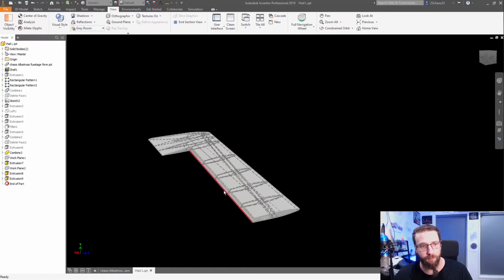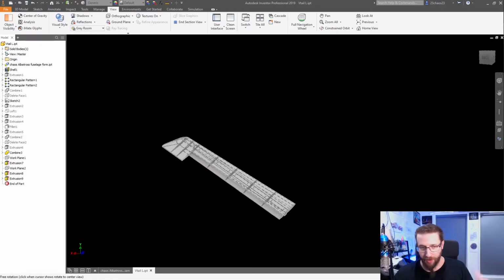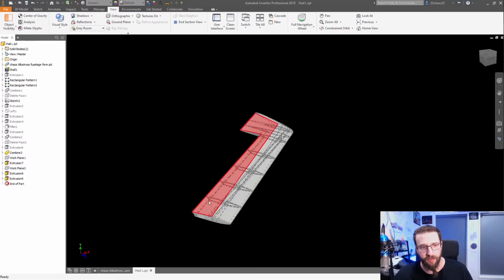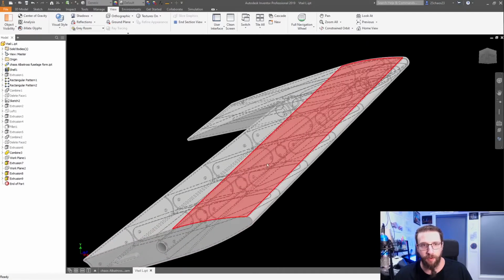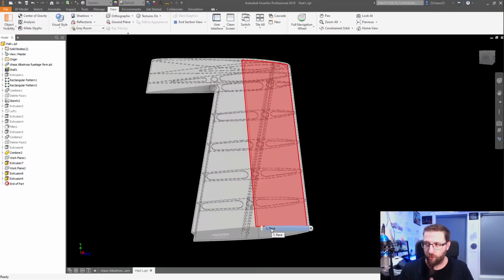So I had some holes in the back here to aid with the drainage of resin. They're spaced along here in the back. And I've just extended that extrusion now to cut through the tube for the carbon fiber rod. So if I do end up epoxying this carbon fiber rod into this tube, those holes would help the air get out through the whole thing as I ram the rod in there, and it doesn't just trap a whole bunch of air at the top so that I can't get the rod all the way in. So yeah, that works well. So there you have it.